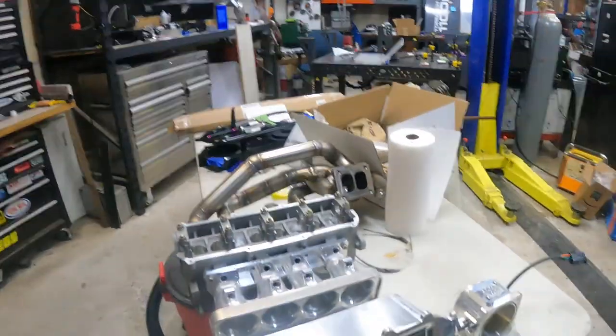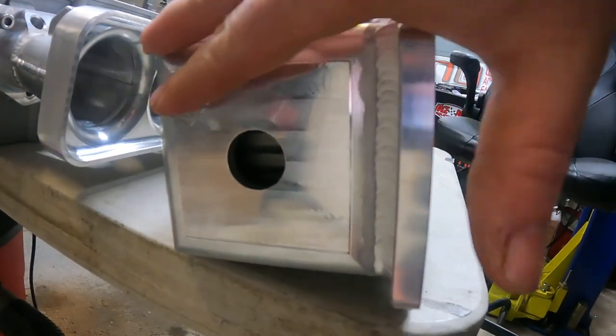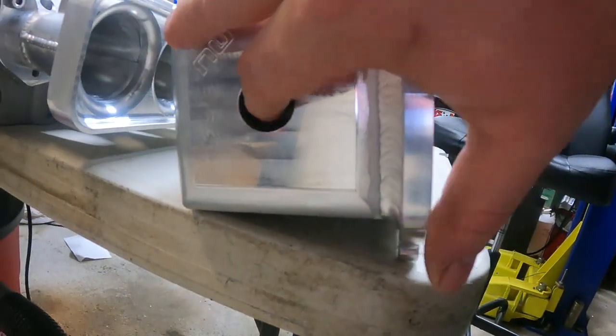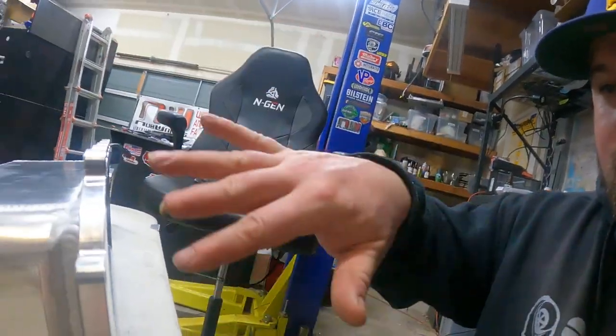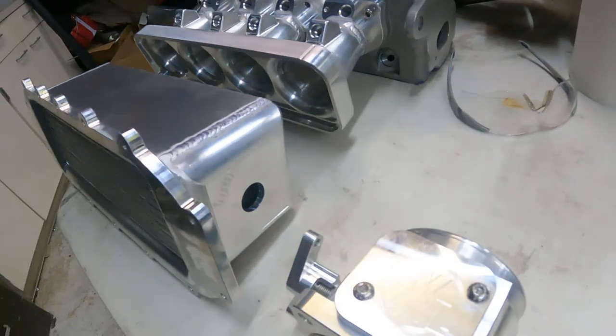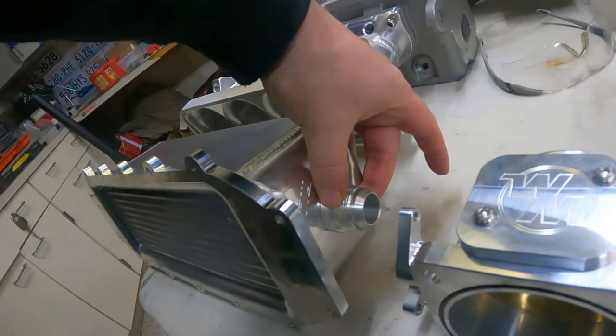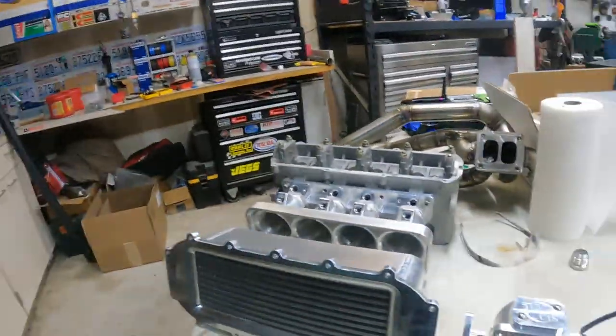So to recap, you just saw me weld this guy off, and what I did was make some intakes right here. They're radiused on the inside. Also, the thought is to get the water to circulate. I made a little bit of volume, but I didn't want huge intakes. So that's all those are. There's gonna be dash 16s welded on. Excuse the squealing over there on the mill. Trying out a new program. It's actually really effective time-wise, so I'll deal with the squealing. But here's what we got.